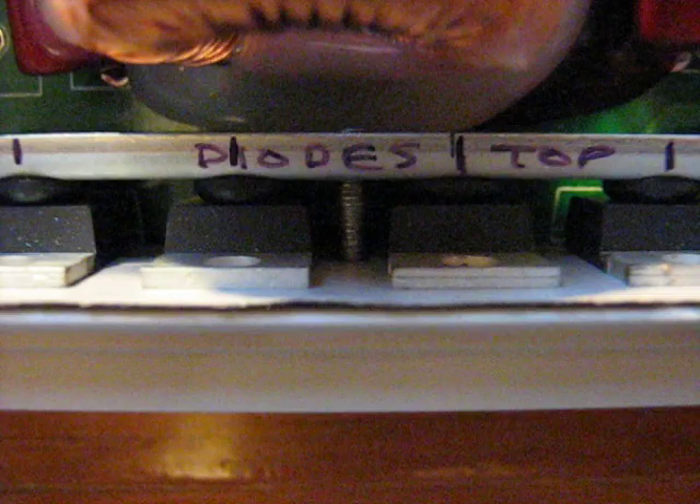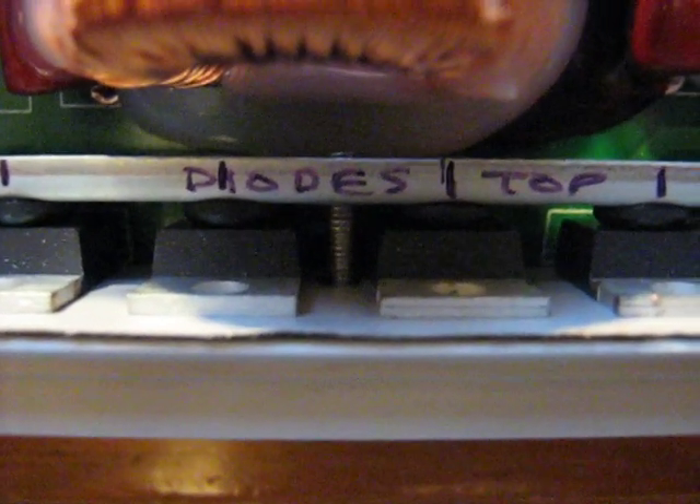So what I did was I bought this strip of little stick-on rubber feet, and then you just grab a foot and stick it onto the batten like that. So if you stick eight rubber feet onto this batten and then reassemble the batten into the unit, these rubber feet apply a nice even pressure. And you can see all the diodes are lying absolutely flat against the heatsink, so you get maximum heat transfer and best possible cooling.